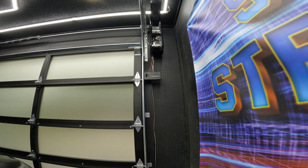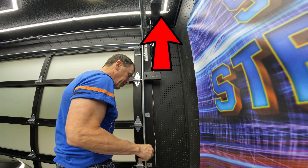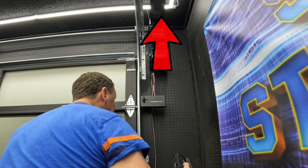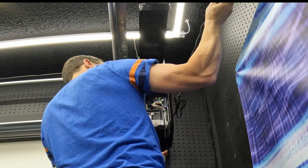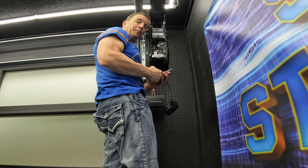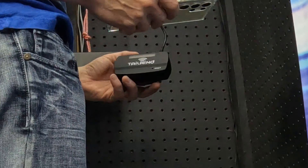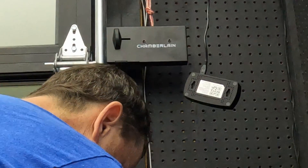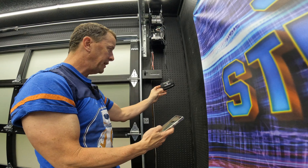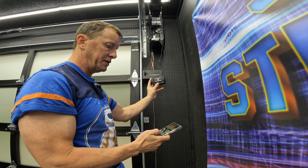For this next step, it wants us to power on the Tailwind controller where the power outlet is that we plan to use. There is one right up here for the garage door opener. I went ahead and powered it on, leaving it hanging somewhat low. Wait five to ten seconds, then check the status light — it is flashing red. I pressed the reset button with the pin tool and it turned blue, flashing blue.